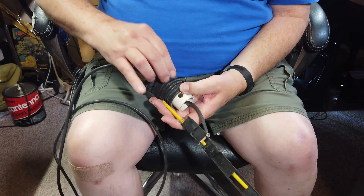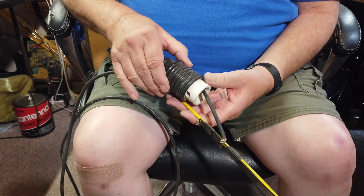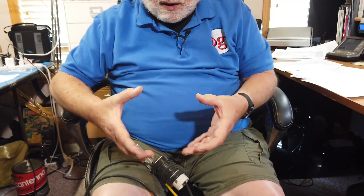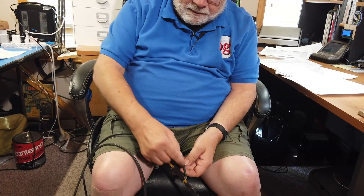So the answer to the question is: how many turns is enough? Keep adding them until your RF problem goes away. Usually that will be eight or nine turns. They can be small for UHF and VHF; for something on HF, you might want something bigger. Another thing you can do instead of a coil type is to put little ferrite beads around the cable — eight or nine of them.